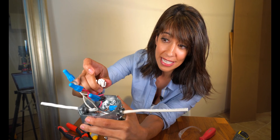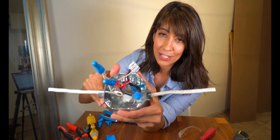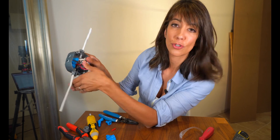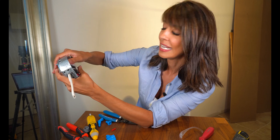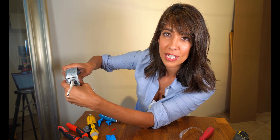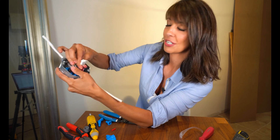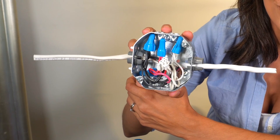After you've made your connections with your AC adapter, we're just going to push the wires neatly into your box. Now I'm not pre-twisting these wires. A lot of electricians will pre-twist their wires, and I do pre-twist everything — except smoke detectors or anything with a stranded wire. I just think it's easier for DIYers. So that is my box right there, and I'm going to leave our AC connector standing out a bit. We have our first box done.